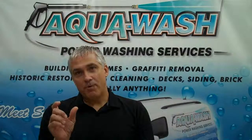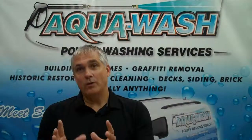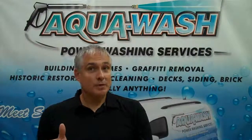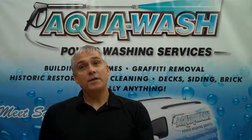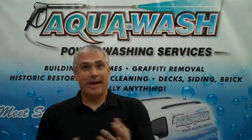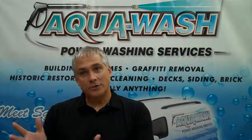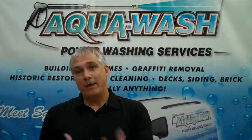We use a cleaner that's peroxide-based that won't harm your vegetation. It doesn't have chlorine in it, but what it will do is kill that biological growth. If you just use a pressure washer, you'll actually drive live mildew or biological spores into the wood. Within a few months after putting your sealer or stain on, those spores will actually come back up. They'll be trapped underneath the stain and your deck will turn an ugly black-brown appearance. It's really critical to use the right type of cleaner, and then the pressure washer sweeps the killed biological growth off your deck and prepares it for the sealer.